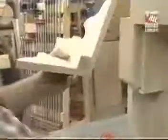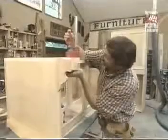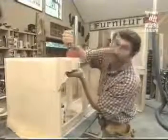All right, now I can take the assembly, drop it over those blocks, line it up with the cabinet, and tack it with a couple brads. Now a couple clamps. Well, as you can see, it's not the nails that are going to do the work, it's the glue.